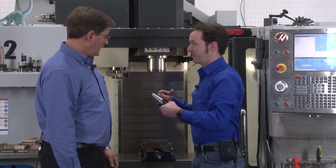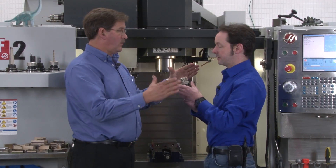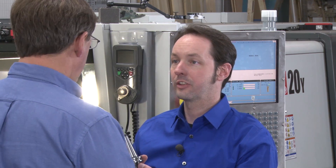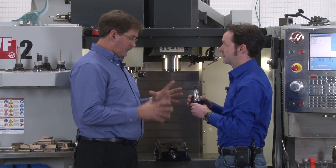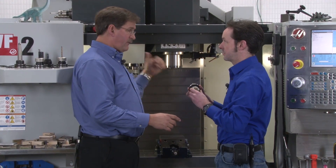You can get tool holders for all kinds of different stuff. Like this is a simple drill, but we've got the T490 — that's a two-incher, and they make it up to 10 inches. It will hold in the spindle, but it won't go through the tool changer — that would make expensive sounds. The Haas does have a feature where if you have a heavy or long tool, it slows the tool changer speed so you don't throw the tool onto the table due to its weight and mass.